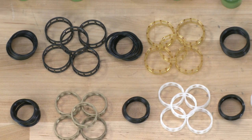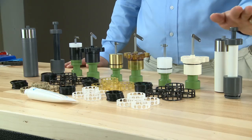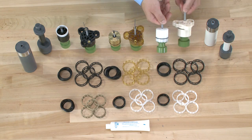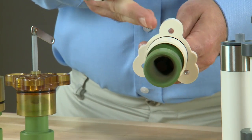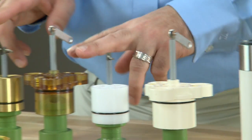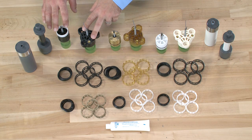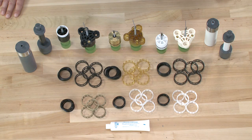We have three kits available for seals and spacers for the 2850, and the 2850S seal and spacer kits in the rear. They use different stuffer and puller tools for the 2850 versus the 2850S. The diameters of the pistons are also a different size. The standard 2850 piston and the 2850S piston — which has a triangle end cap — are available in hard water bypass with a white end cap, hot water with a brass or colored end cap, or black end cap for no hard water bypass. We still use the same silicone lubricant for all seal and spacer sets, but make sure you select the right piston, seals, and spacers for your installation.